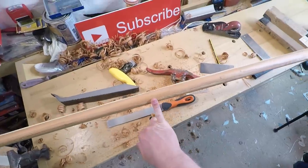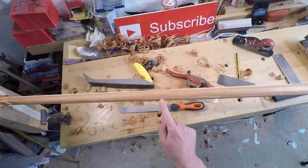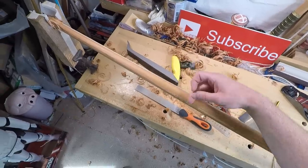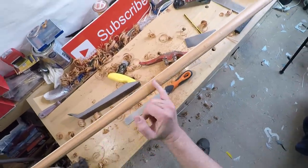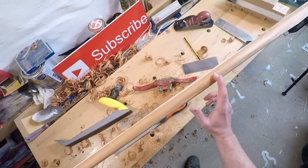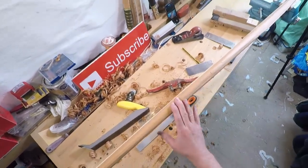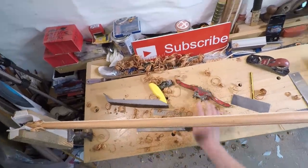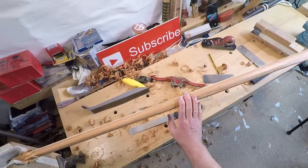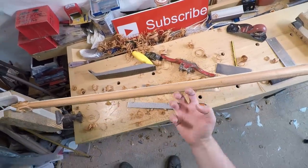Okay, so I hope that makes sense, that when you've got an area like that, so you've got a center of the swirl, say like this bull's eye, if you imagine, if you work one way away from it, it won't pick up, and then work the other way from it, you hopefully won't pick up. But I say the safest thing to do is, when you find an area picking up, ignore it. Or better still, if you're not confident with the spokeshave, do all the work with something like a surform and a rasp, and you'll hopefully avoid most of those problems, because they aren't as serious as a blade. They aren't as likely to dig up.